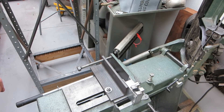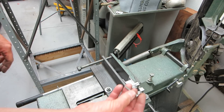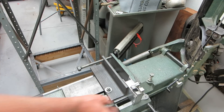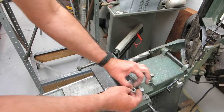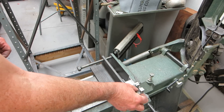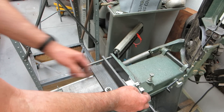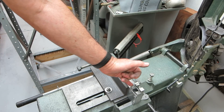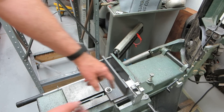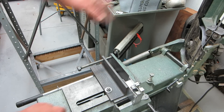Now it's set. Here's the bolt that I set the length with. Here's another bolt that's the same thread size but is too long. Notice, back on the back side here, there's a piece of hacksaw blade that's been beveled on the top to a 60-degree included angle to match the cross section of the thread.